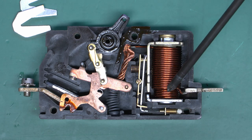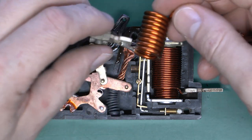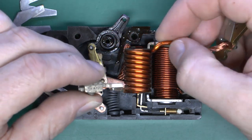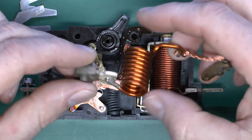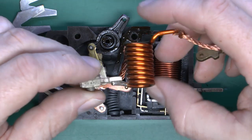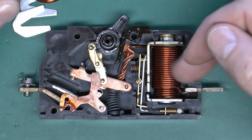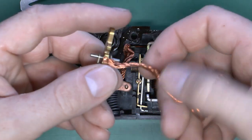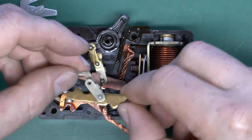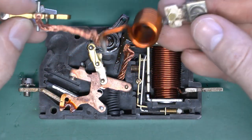This is a 6 amp breaker and the wire on it is reasonably small with a considerable number of turns. I've got here a coil from another one of these circuit breakers — this is actually from a 30 amp breaker. You'll see the difference: the wire is considerably thicker than in the 6 amp version and there are considerably fewer turns. Fewer turns means you need a lot more current to get the same magnetic effect, whereas the smaller current version achieves the same magnetic effect with a much greater number of turns. This is the movable contact equivalent — one appears to be brass in colour and the other copper.